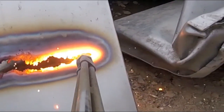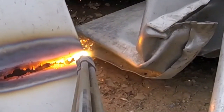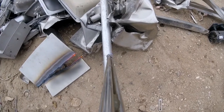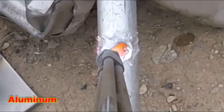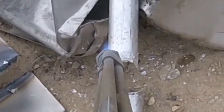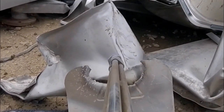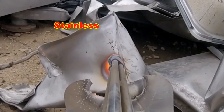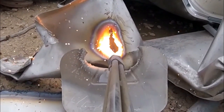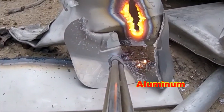This isn't the best method by any means — it's just easy when I'm cutting iron screws off or something like that. It's easy to tell the difference, but at this point hopefully we've already determined what it is because we've already bought it. Right here is a piece of aluminum — you can see it melts, it just melts right off. It's a lot different — you're not going to see a big glowing line there. Then on this clip I did a piece of stainless and right underneath it is a piece of aluminum, so you could really tell the difference side by side. You see it glowing real hot, pushing out those flaky pieces, and then it slides into the aluminum piece that just melts off and you're not going to really see a glow.